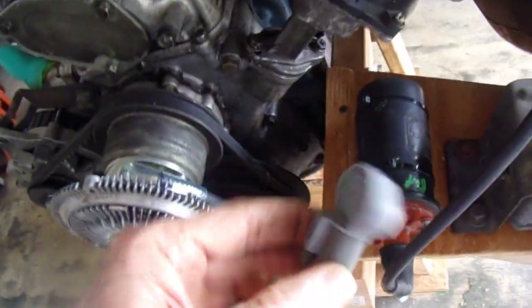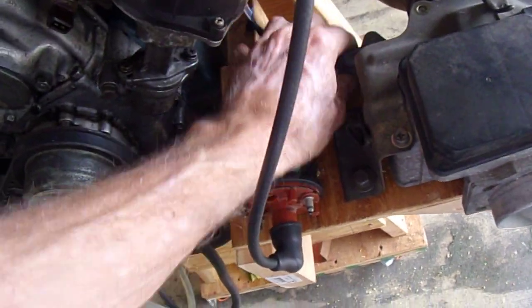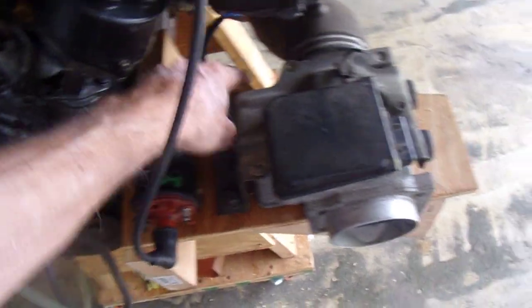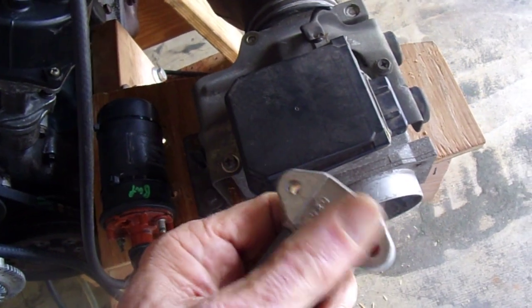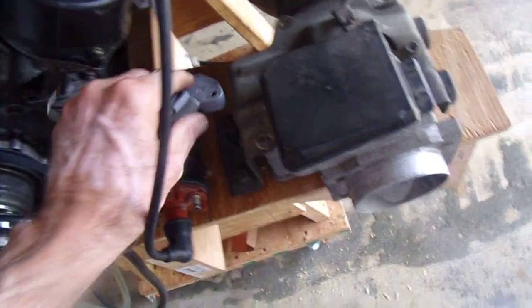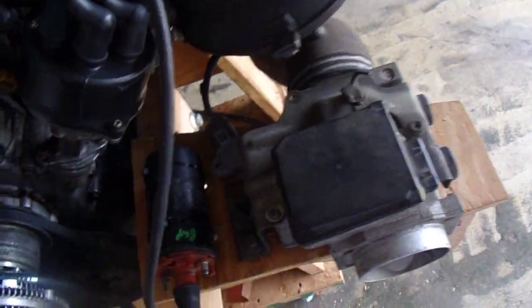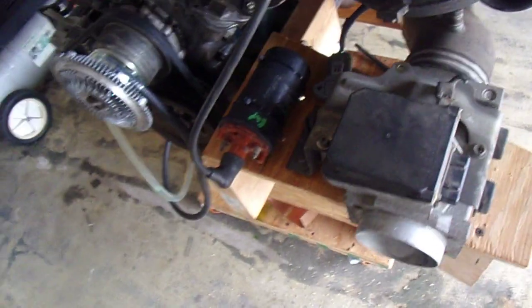This is the transistor that fires the coil. I'm not exactly sure what I'm going to do with it — I don't know if I need to worry about heat-sinking it or not. It's got aluminum on the bottom so I assume it's supposed to be heat-sinked. I might mount it to a piece of copper and let it overhang something to handle that.